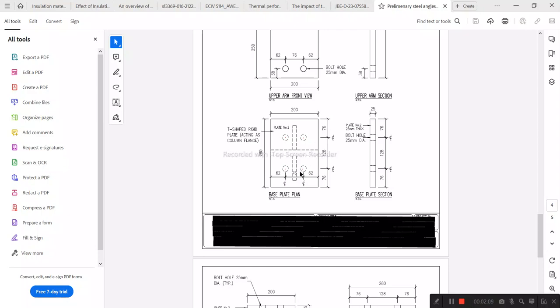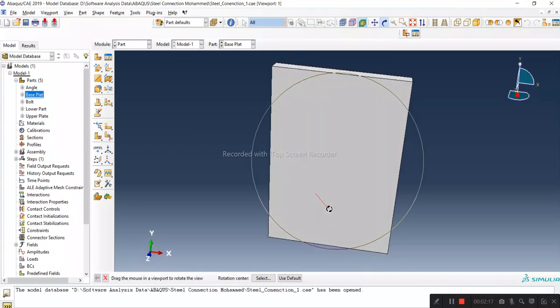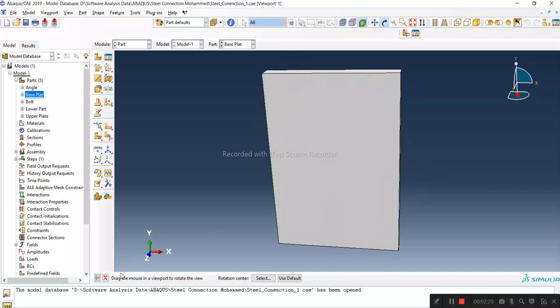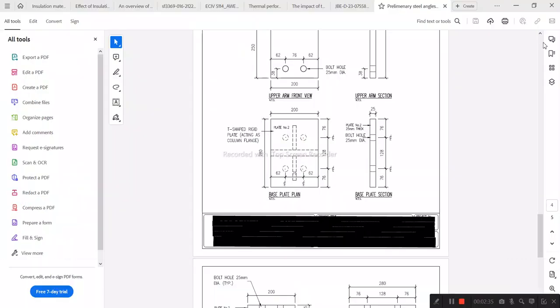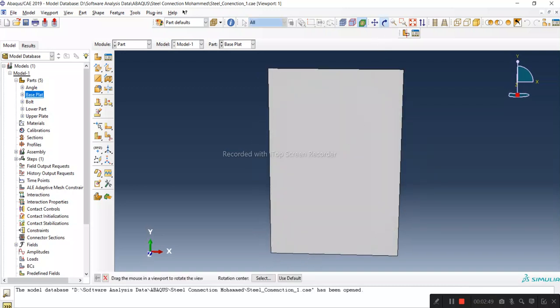The first thing is that whenever you are planning to edit any particular section, you might need to do some pre-calculation, just rough calculation on your sheet, like what's the location for that, and what's the center of your hole. Although it might be mentioned in the drawings that this is the center, you need to know where this center is measured from. For example, it's 1/3 from here, 2/3 from here, or at a specific distance from here, and also a vertical distance as well. These are the things that really matter, and you really need to do some pre-calculation so that everything is ready when you're modeling.